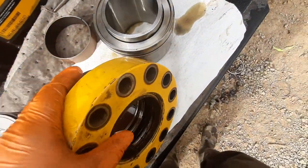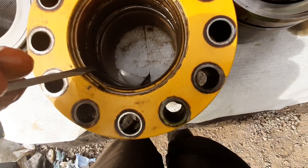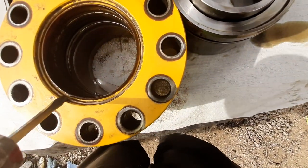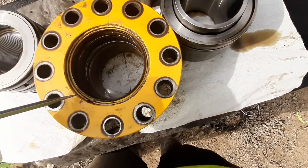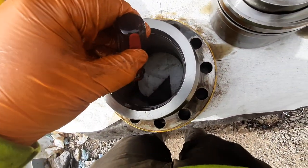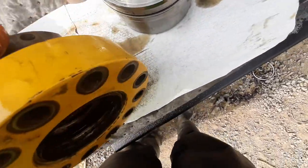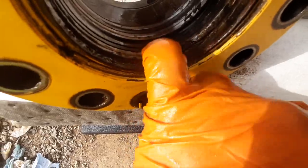On the top part of the gland there's also a snap ring that holds in the dust seal. Usually you'll see oil coming out of the dust seal because it goes bad and starts pulling in rock and debris that wears out your other seals. Take the snap ring out — it's best to flip the gland over and use a small chisel or crowbar, get it up into that lip, and overhang your gland off the side so there's space for the seal to pop out.